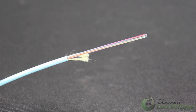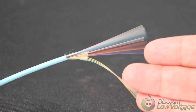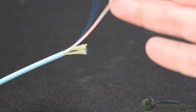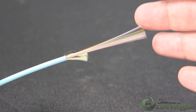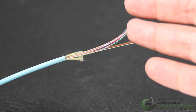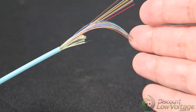Here's a quick look at the MicroCore by AFL, and this is designed for high-density infrastructures — this will save you both space and fiber management and routing infrastructures. Now, this is your 24 strand, and the jacket itself, each strand, it's got the 250 UM buffer — that's why it's quite a bit smaller than the older stuff. And this would be a great choice for MTP cable assemblies.